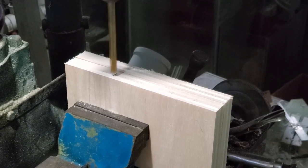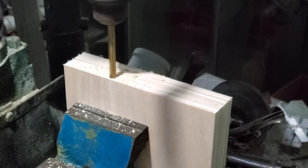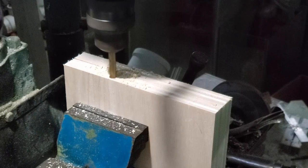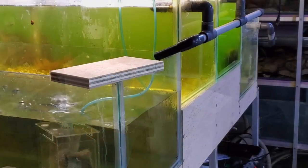Now I need to add water to this. The particular drill I have here says you don't need water, but I have always used water when drilling glass — it keeps it cooler and you don't want the glass to heat up. So this is going to be a channel that goes down to that hole, and this is how I'm going to add water into it to keep it cool, so I can focus my entire attention on drilling the hole.